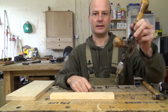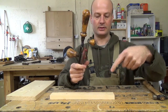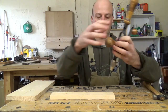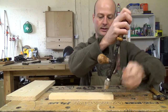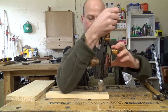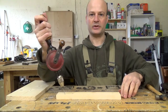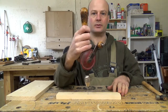The way to drill for skew nailing is to have one nail at this angle coming in — you wouldn't want it to go that way, you want it to go this way, and at the opposite end you want it to go this way. So just hold your drill like this and away you go. That's all the way through. Drill the other one in the opposite direction, and the one in the middle just drill straight. Then we'll nail it together.